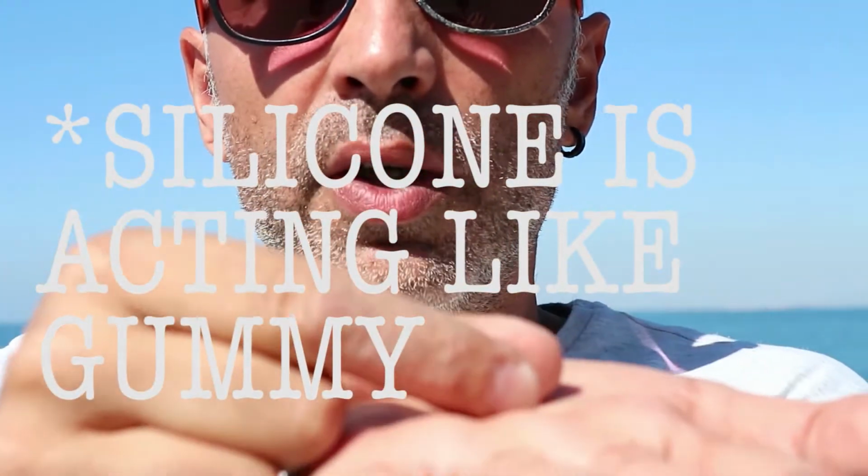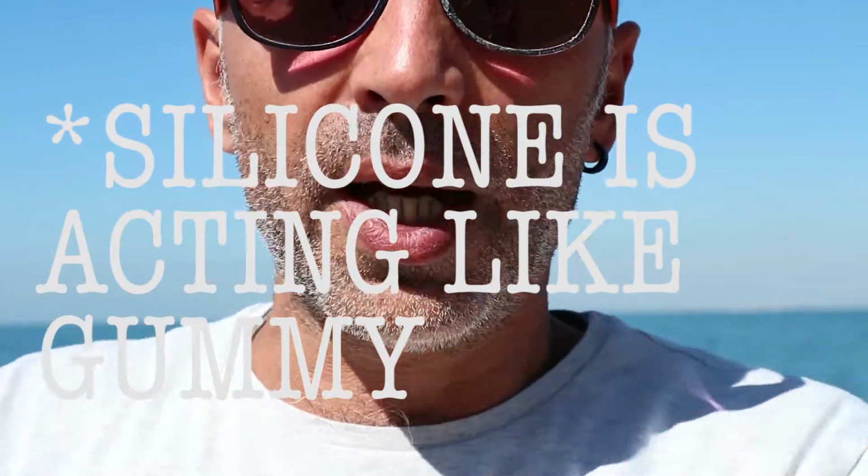Silicone. Silicone is some soft stuff, normally, but I don't know why. When you try to get silicone out of the tube, there are sometimes some pieces, particles. So when you press your tiles on your mesh, it will try to come up. You can't see it with your eye, but you can find out later when you get that call about your pool. So silicone, never use in a pool.